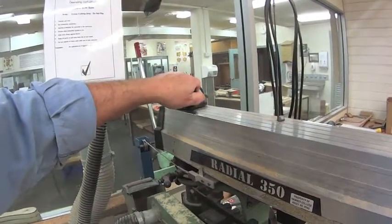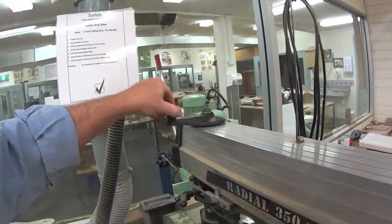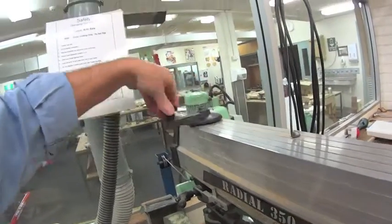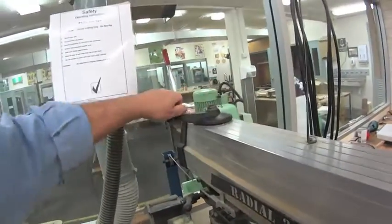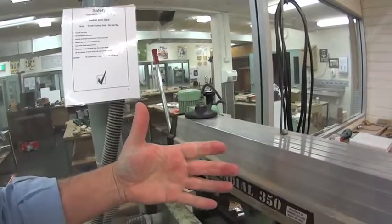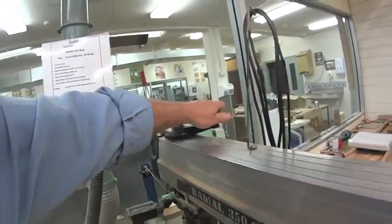On the down stroke, from that point to about there, a half turn is slack — that's play in the teeth. If you finish adjusting on the down stroke and then turn the machine on, the chances are it'll drop that half a turn and your adjustment will be wrong. So wind it down to where you want it, take the slack out, and finish on the up stroke.